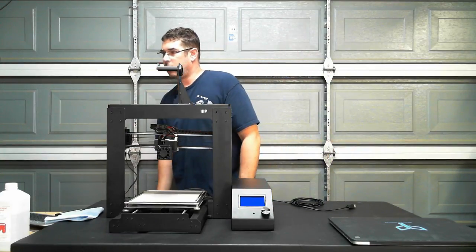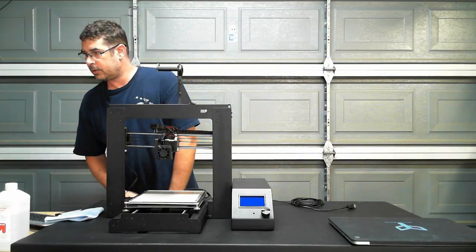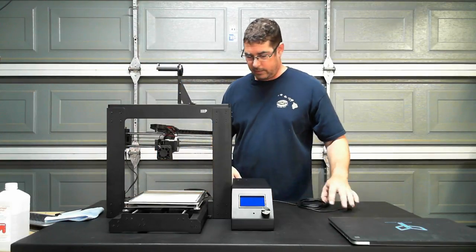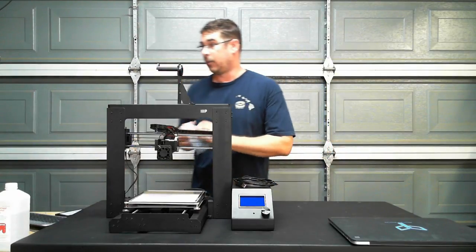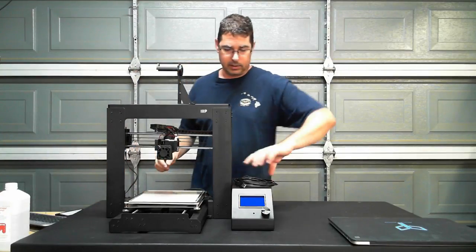And I hear the concern with the buzzer. Sorry, Ray, I hadn't seen the chat. Yes, M119 is one I am well versed in. Dealing with troubleshooting BLTouch issues, M119 is my best friend out of many of the G-codes.